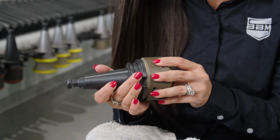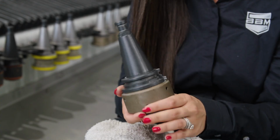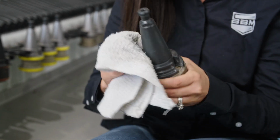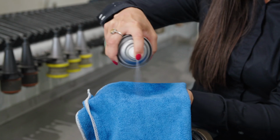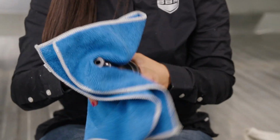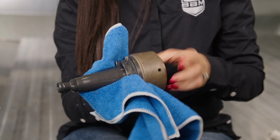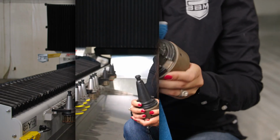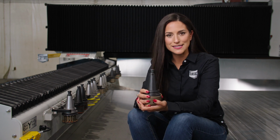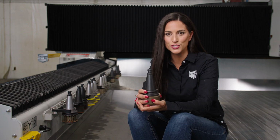Before cleaning the cones, first assess for any damage or rust to determine replacement needs. Once you've done that, wipe away any dirt or slurry from the cone. Then, using a microfiber rag, spray the appropriate protectant solution to the rag and apply a light film across the entire cone. This step helps keep dirt and slurry from sticking to the cone. These cones should be cleaned on a daily basis. Refer to your maintenance schedule within the Commander software for guidance on what protectant solution to use.